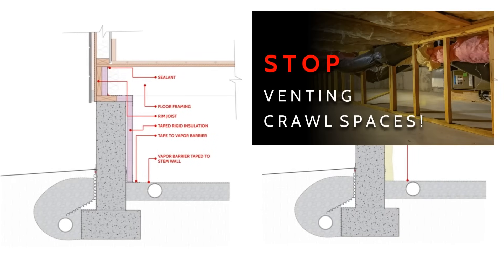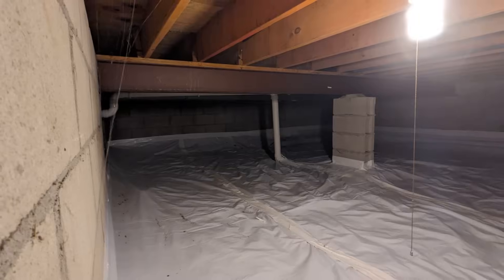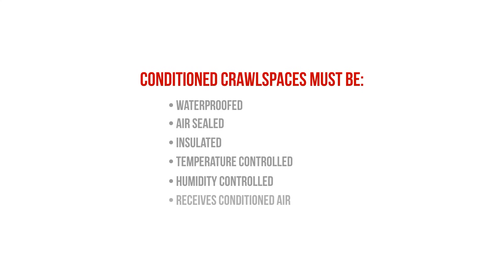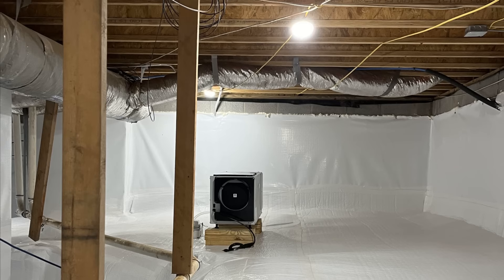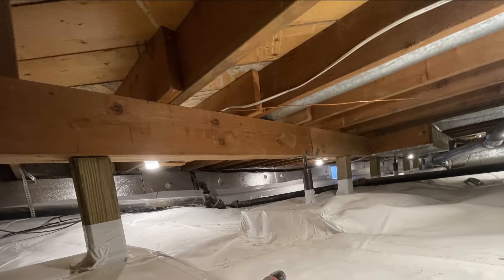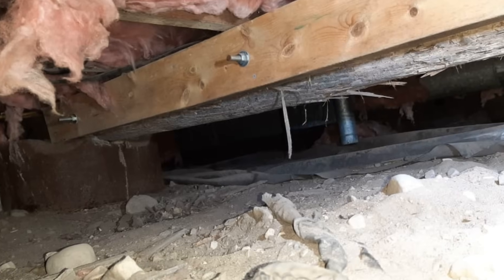We actually have a whole video on the differences between vented and conditioned crawlspaces, which you can go and watch up here. But a conditioned crawlspace is waterproofed, air sealed, insulated, and kept at the same interior conditions as the rest of the home, as it's temperature controlled and humidity controlled. You can run your ductwork freely within the space without any penalties or risks of bringing in any contaminated air into the home, and overall it serves as an excellent interstitial space to run mechanical services. And with that being said, it makes maintenance on these surfaces a breeze compared to a typical ventilated crawlspace.